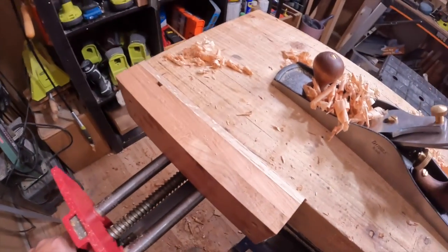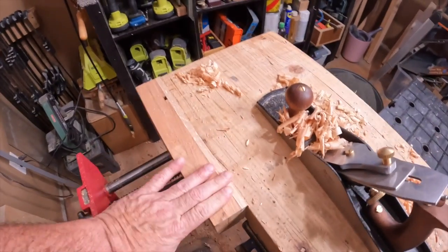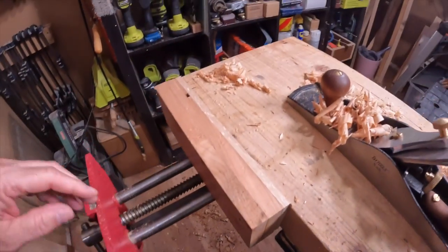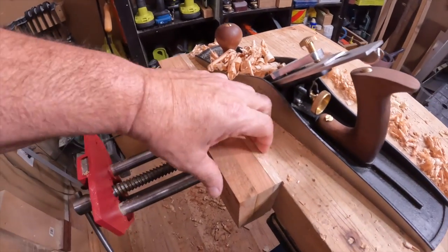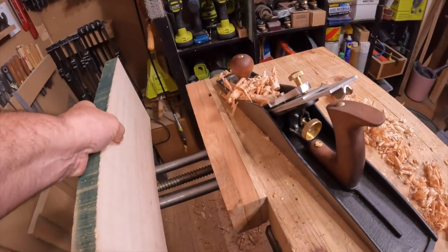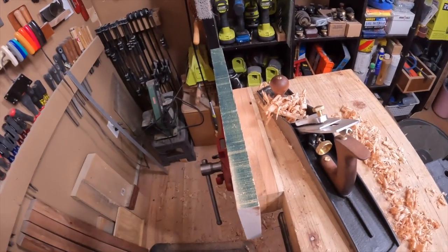After I got this completely glued up, I'm going to show you a picture after I take it out of the clamps, showing the oak making the cavity. Here you can see I've installed that piece of cherry with the oak. Here's the strip of oak that just kind of goes around - what it does is the other piece of cast that's up against here is buried in that cavity. I've been trimming this down with my hand plane. I've got about another quarter inch to go. Once I get that flat, I will make the chop for the other side. I have this nice piece of hard maple here which I will cut to size and put here - that will be the other end of the vise.